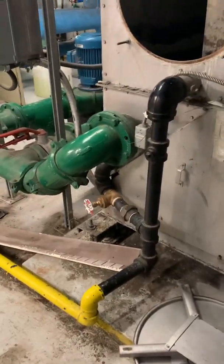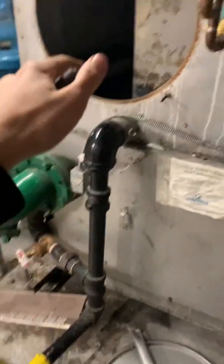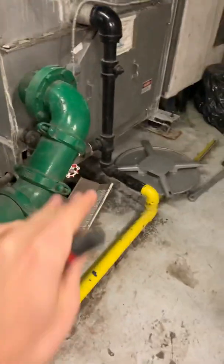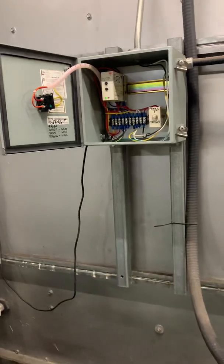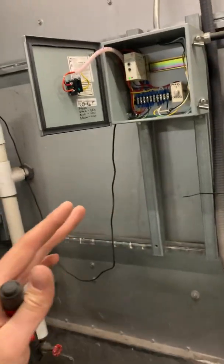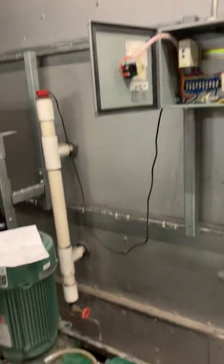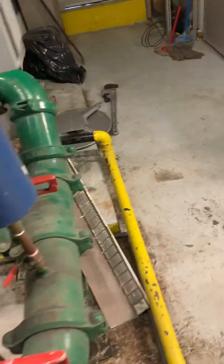That drain issue is fixed for now. What still needs to happen: we're sending a quote to put in a second union, replace the existing union, adjust the piping so it actually lines up correctly, and vacuum out the rest of the scale at the bottom of the tank. That is more immediate — we need it fixed because we don't want a blowout flooding the whole place, as I'm in the penthouse right now. Second, the relay I want to replace — it's original and I don't trust it for more than maybe a year. I told them they don't have to approve it right away, but at least we want to have a quote on file so when it does fail, they have a price and are budgeted for it. It's always good to have your customer prepared for a cost rather than throwing it at them randomly.